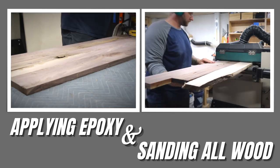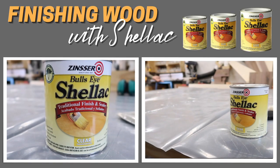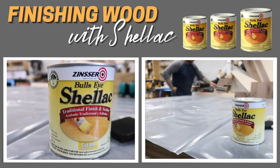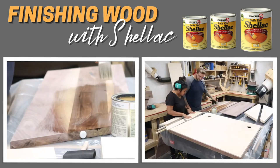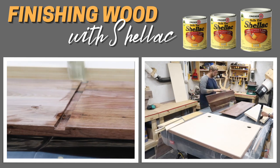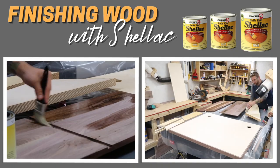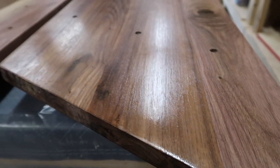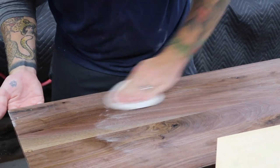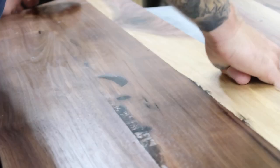Going to be sanding and working on the finish. And for this finish, we went with shellac. And this is actually the first time that we've used shellac in this wood shop. And I've got to say, I really like working with it. The smell is its greatest downside, but how quick it dries and how fast you can sand and put multiple layers on is definitely the best plus. We will use shellac again.